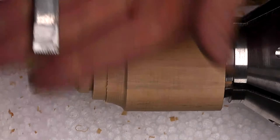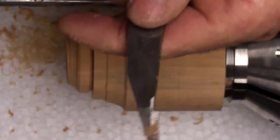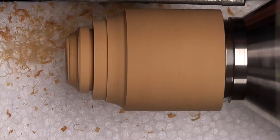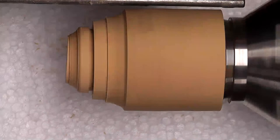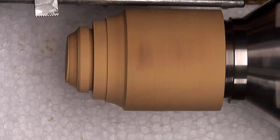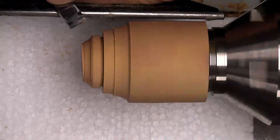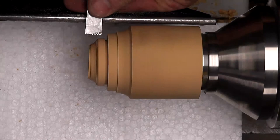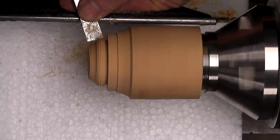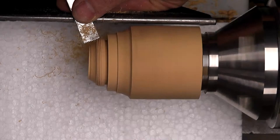External chaser - let's get the two together so you can see the difference. Internal and external. So that's what we've used already - and now I have one with lots of little teeth. We've got to take our speed back down. I'm going to come back a little bit with the tool - not loads, because we've got that recess off the body material. Take the speed down - still way too high. Electric variable speed makes this so much easier to do.